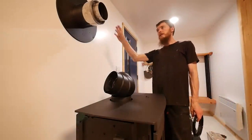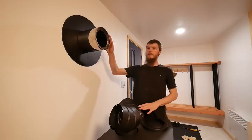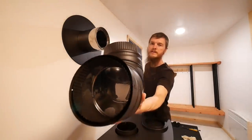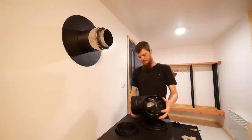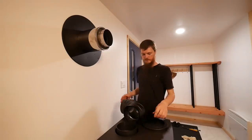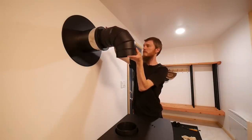I got the wood stove more or less where I want it. Now I'm going to attach the chimney and make sure everything is straight, plumb, and level. This is the actual chimney pipe coming in from outside — stainless steel double wall. To convert it to an interior pipe, we use a little converter ring. It was recommended I could spray paint the pipe black, but I opted to leave it silver — it doesn't offend me. I picked up a finishing ring to cover the open edge and create a transition from silver to black.